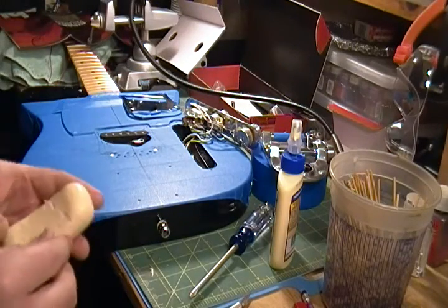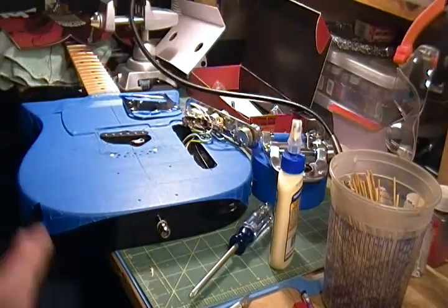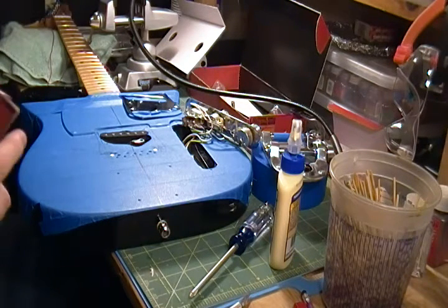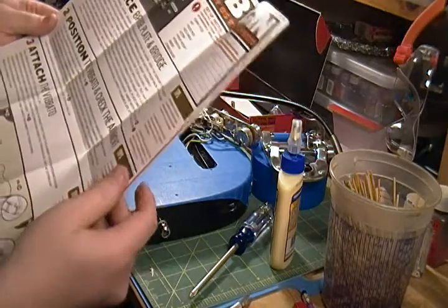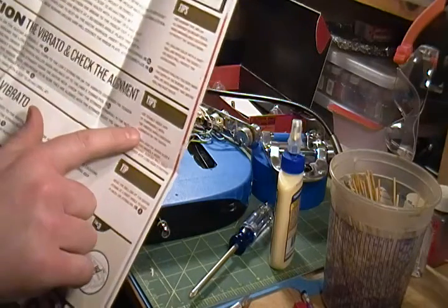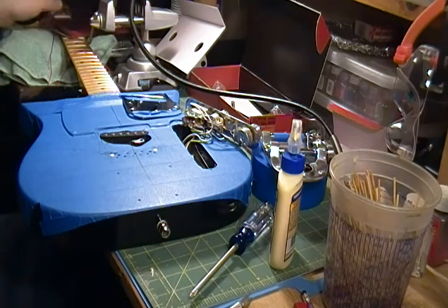This is for lubrication. So you just take it and you run it through the threads, and then when you put it into the wood, it allows the screw to go in a lot easier. It just lubricates the screw ferrules and whatnot. It's right here in the tips. So it says dry bar soap on wood screw. So that's pretty cool. That worked out.